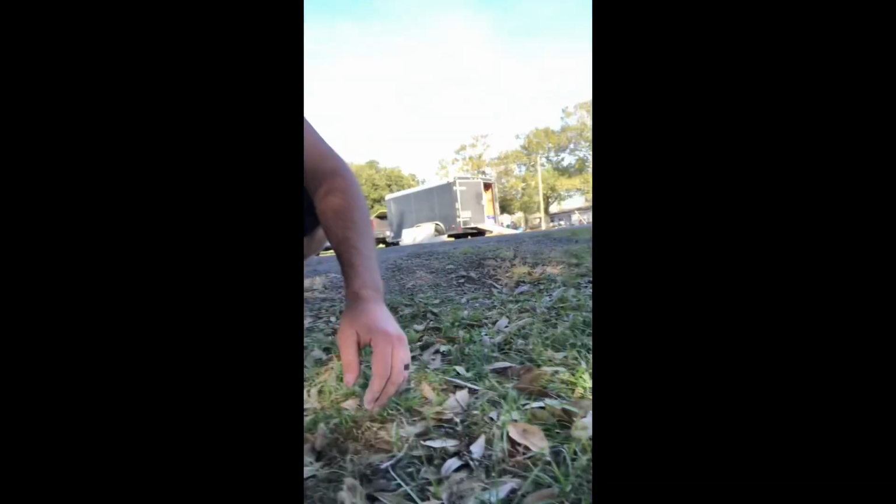This is asphalt. This is crushed asphalt. Now, you should be able to see the different level of how high this is. It's actually like 12 inches of rock. It's just the grass grew over it, so it's kind of hard for y'all to tell, but this is asphalt. So asphalt kind of packs like 610. It does have a good base. I noticed it took about 4 times longer to pack than 610. So it's still good. It packs really, really hard. Just from my experience, I noticed it took a lot longer to pack.